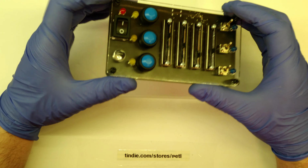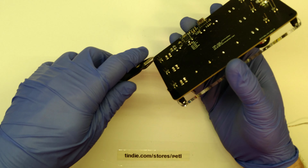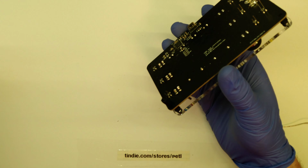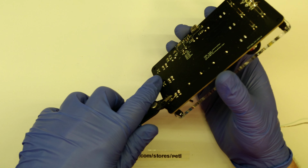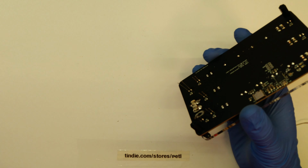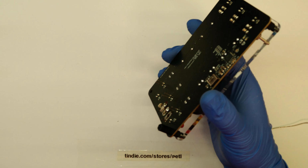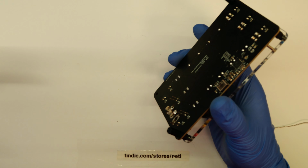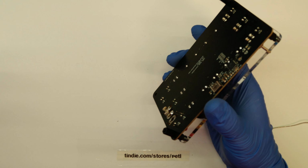So a quick click through, clicky clacky, and now with my pliers I can cut stuff off. Those are special electronic pliers for cutting stuff off quite easily and at the perfect height in correlation to the board. I would not recommend cutting off the solder joints directly at the board height, but leaving a bit of the wire sticking out in the end. This helps if you want to reflow or resolder stuff, so that you can actually see what's going on.